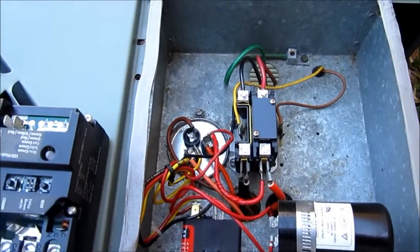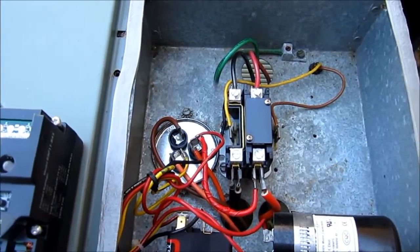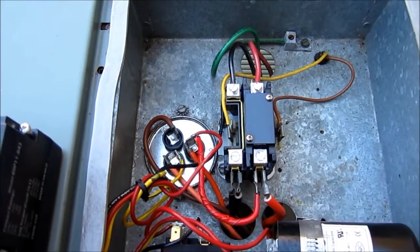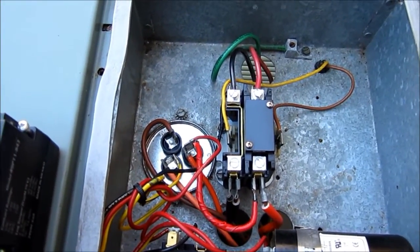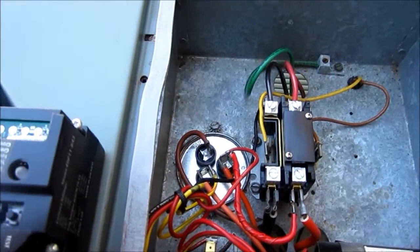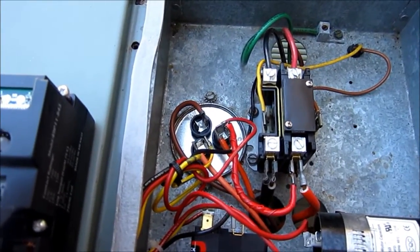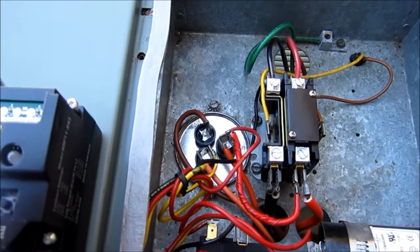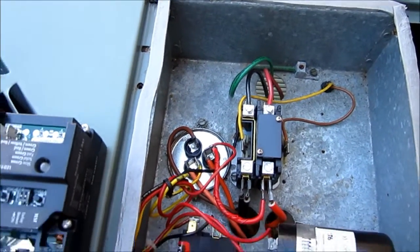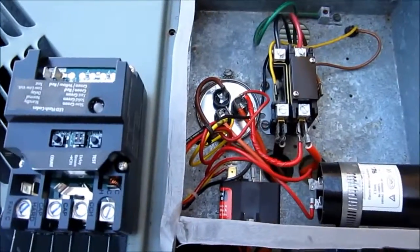I don't know — not heavy enough, or low voltage, or what caused it. And the Emerson Sure Switch will eliminate that from ever happening again, guys. I think what had happened to the contactor before this one is it got so pitted that it welded shut — that's what happened the night it stuck on without the indoor blower. But the Emerson Sure Switch has an algorithm built into it that reduces the arcing between the contacts, which nearly eliminates pitting and welding for a longer life. And welding is what happened to mine. So never again, RHEEM.